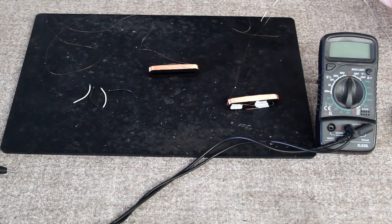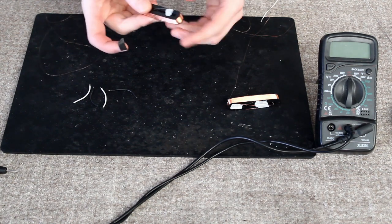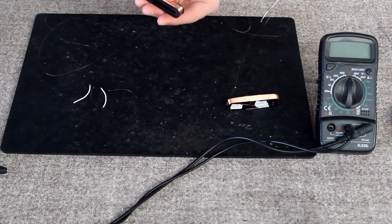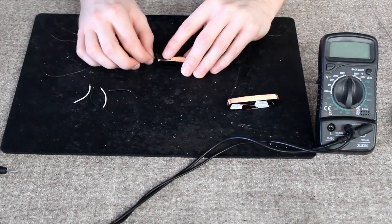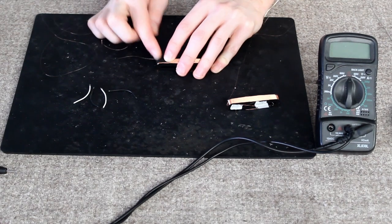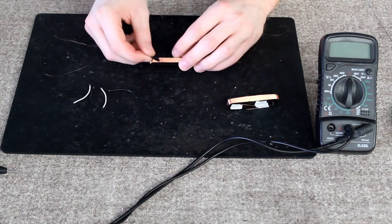First, I'm going to tape the coils and get the fly leads connected to them. I'm looking for the start wires on that side — I want the end wire to be on this side and the other side. I'm going to tape next to that one and next to this one on this side as well.